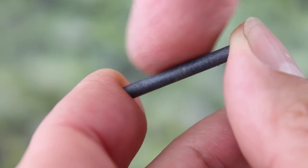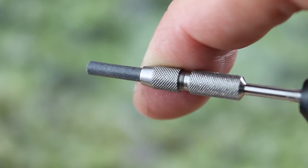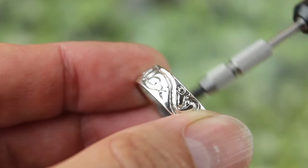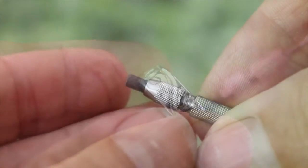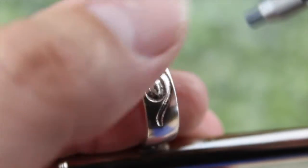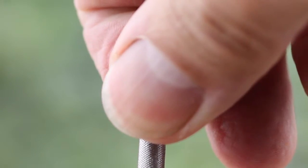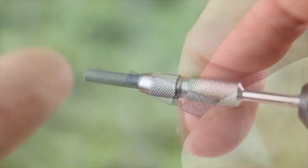Because the whole pin is impregnated with grit, you can use it any way you wish. For larger flat surfaces, you might wish to pull a bit more of the pin out and use the flat side, or to give you a bit more flexibility, because it bends. Alternatively, if you want to use a shorter pin, it will be stiffer and allow you to use a bit more pressure on the tip. Depending on the use and the material that you're polishing, they will wear down. As they do so, just loosen the screw, pull it a little bit more, and re-tighten it. When you get down to the last few millimetres, replace as necessary with a new pin.